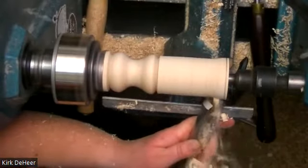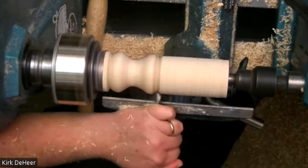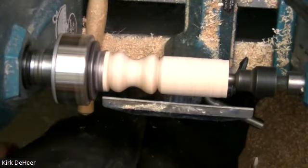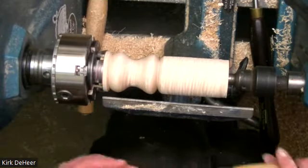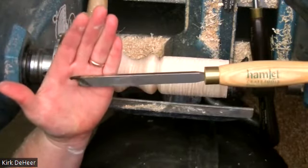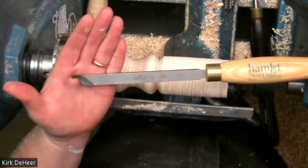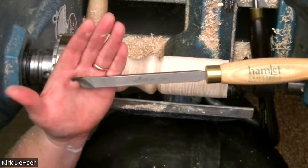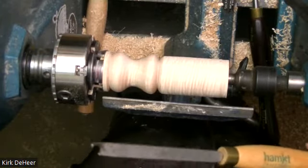We're going to pull this down because we don't need all of this material — we're going to pull my roughing gouge back out to remove a lot of material quickly. We're going to roll a bead just to get started — so there's the beginning of our first ring. Now we stop and reach behind us to grab the captive ring tool. This is the three-eighths captive ring tool by Hamlet. I love this tool — I have purchased this tool more times than I'm willing to admit because when I started turning I was a complete novice.